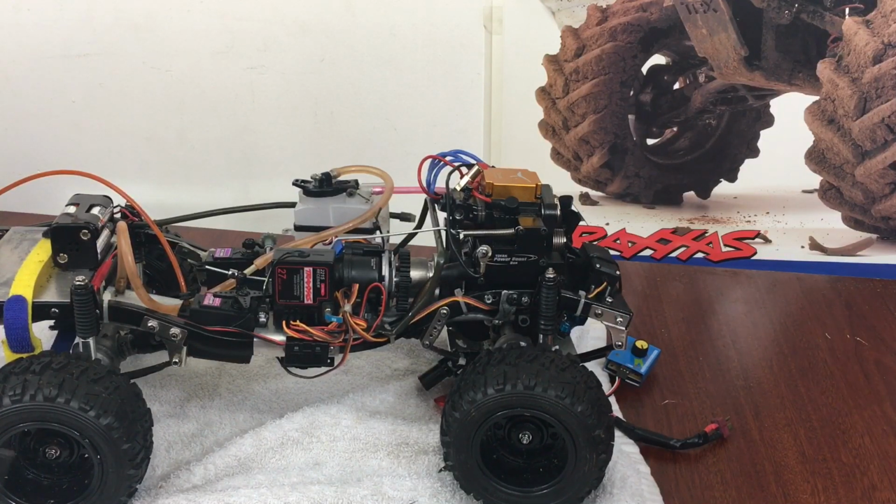It's more rearranging everything. Some brake tubing to make your own kind of a cross member. There are two small 3mm holes on both sides of the engine. What I did was I took 3/16 brake tubing and a really long, I think they were about 40mm, 3mm screws, and I put them in there, and then I slipped the brake tubing over top of it, and then tightened these nuts down to squish it into the frame so the motor was solid.